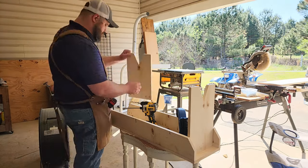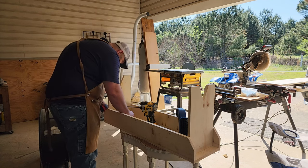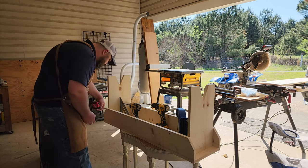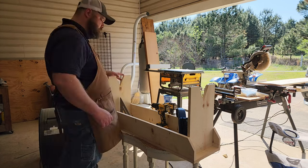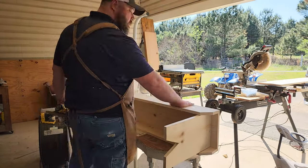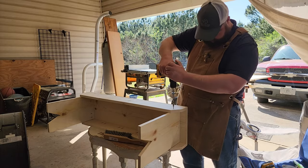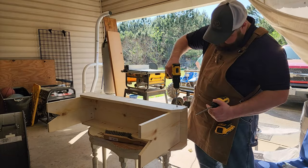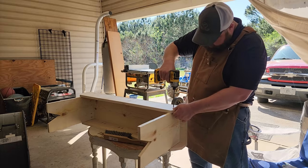I'm going to do something neat in a few minutes after I get this all lined up. I need it to be more sturdy than just the pocket holes, so I'm going to drive two and a quarter inch screws into the sides to hold the legs to the front and back plate, but I'm going to countersink the holes with my Kreg drill bit. Now that is a very aggressive bit — I don't recommend you do what I did and I won't do it for the next build. I'll use a standard drill bit so I can control the depth much easier. Make sure you mark your holes first and use something to leave an indentation in the wood so you can drive that drill bit in there easily.